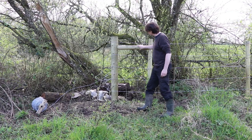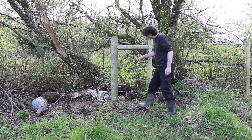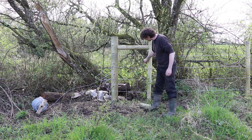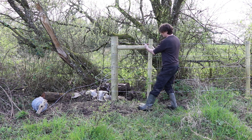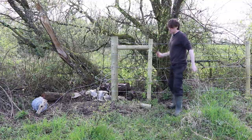Having put in place the support, you then get some wire, lap it around from low on the strainer to a high point on the support post, and you just tighten it. So that helps keep this in place — if the strainer tries to go this way and push this back, it's pulling against itself, and that locks it into position.